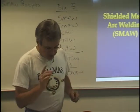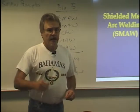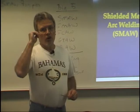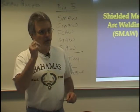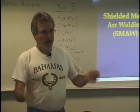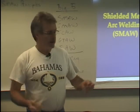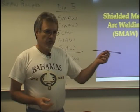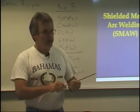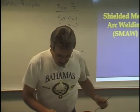The single most important thing to remember, and this very well could be a question on your test, is that when you're going to weld, you have to try your best to match the filler metal to the base metal. So you want to have the same mechanical property. So you're going to look at the tensile strength, the ductility, the carbon content, and you're going to try to find a welding electrode that comes as close as possible to the thing that you're going to weld. Okay? Let me continue reading.